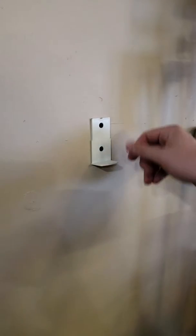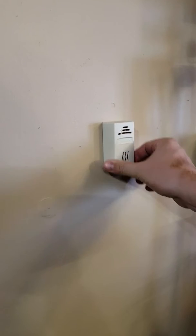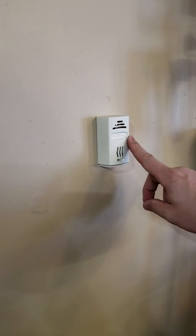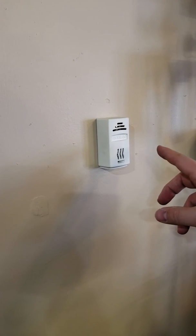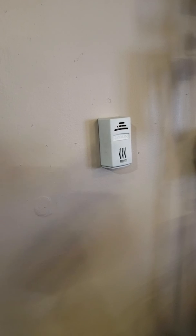All you have to do now is screw your bracket to the wall, and up to 30 feet away we can have this sensor — it just slips on like that and you're done. Now the stove will actually measure temperature at this point in your home and not around the back of the stove. So it's great for transferring heat in different parts of the house up to 30 feet away. Hope that helps.